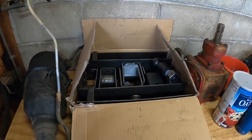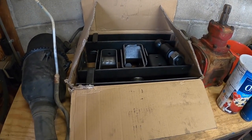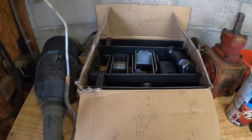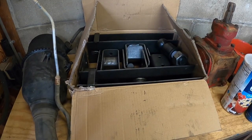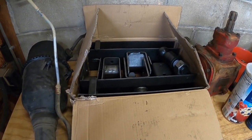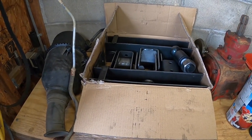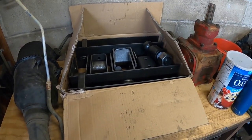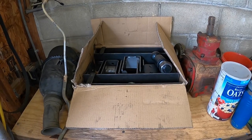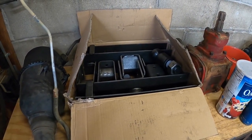Here are the parts that have been the major holdup on the trailer axle swap from the beginning. The 10,000 pound axles run a two-and-a-half inch slipper spring setup, and it's kind of oddball. I had trouble finding a manufacturer that made that setup, and I finally found one and ordered the parts — but they were on back order. It stayed on back order and it was just a domino effect. Finally, after about six or eight months, they just canceled the order. It kind of got pushed to the wayside, but I finally found another manufacturer that sold these, so we got those on order. There's also a 30,000 pound gooseneck ball there for the service truck.